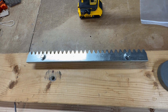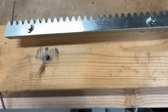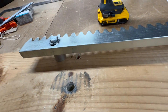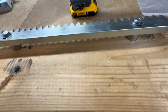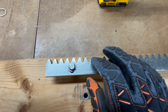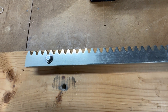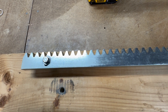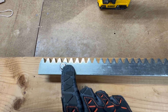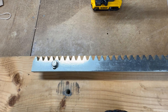This is a small section of the linear drive track from the observatory. It's a fairly thick piece of metal with gearing on one side — pretty heavy duty gears — offset about a half inch from the mount board with a spacer. The holes are slotted so you can adjust the track back and forth to keep the teeth well engaged with the drive gear. Over time the wood it's attached to could shrink or twist a little, so you want that adjustability — you can loosen, slide back and forth, and tighten again. The most important thing is to keep the track from moving away from the drive gear.